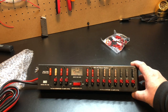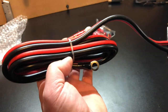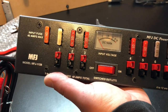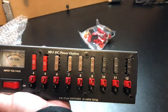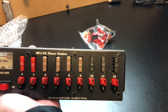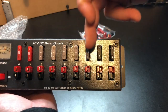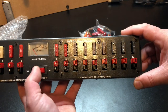You've got a meter so you can monitor your voltage. Nice, big, heavy-gauge wire. You've got a ground lug here. These first three fuses are always on. And then you have this switch — so all of your other accessories like your VHF radio, a battery charger, things you're testing that need voltage — anything you don't always need on. You've got nine other switched sockets to plug into. You've got holes for mounting as well.